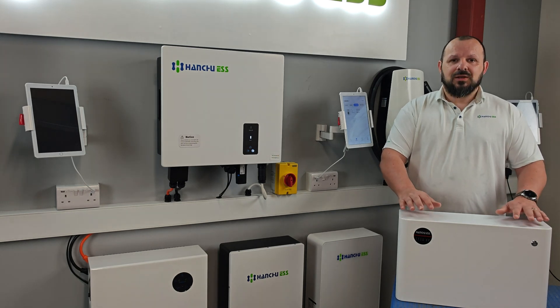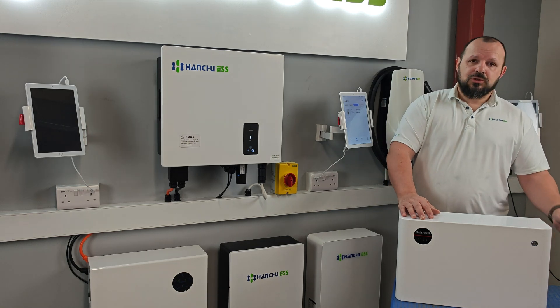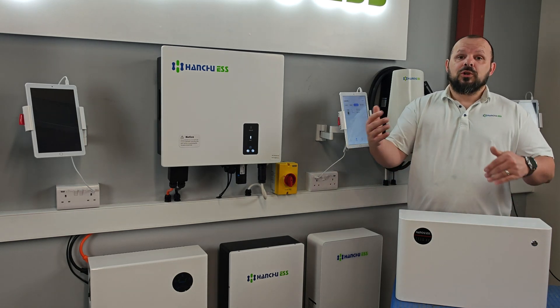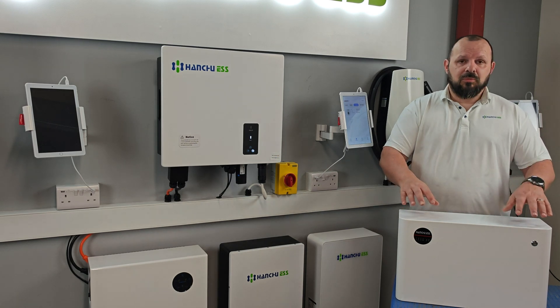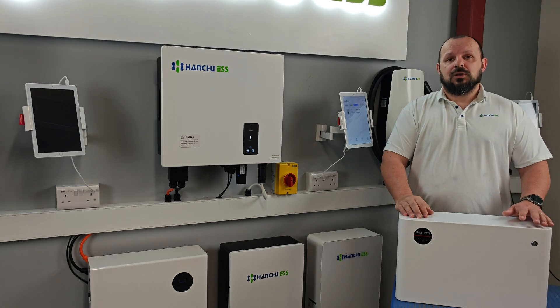So wherever you can, it's essential that this becomes the new number one battery. Change the dip switches — change the dip switches on the current batteries while they're in the off state. When you turn everything back on, everything will register on your platform with the correct address.